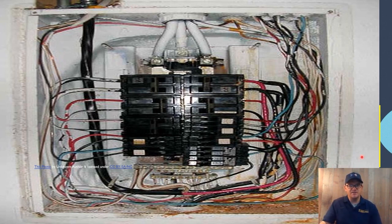Let's say this panel is in a basement that is temperature controlled. Well, the outside is not temperature controlled, and in between is just going to be a condensation tunnel — it's exchanging air. It is drawing the outside air in under certain pressures and drawing the inside air out under certain pressures. Some panels you can take the cover off and feel the wind blowing inside, depending on the pressure, depending on whether or not you have the basement door open. The difference in temperature is creating essentially a condensation chamber for this panel, and that's probably what has happened in this case.